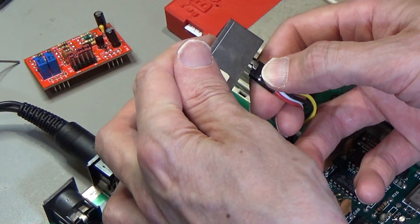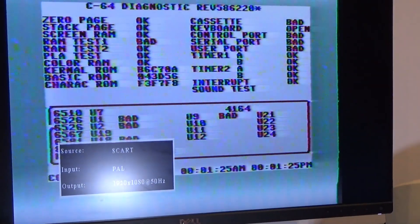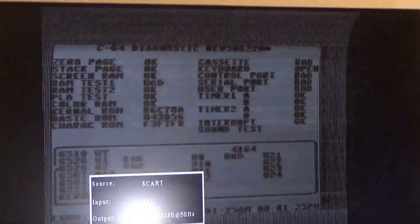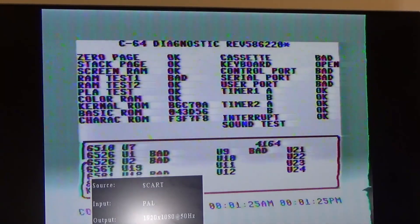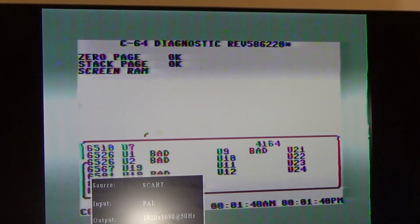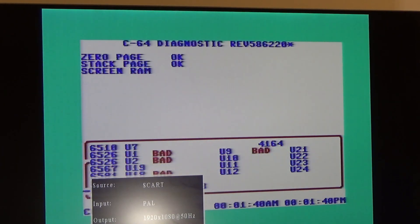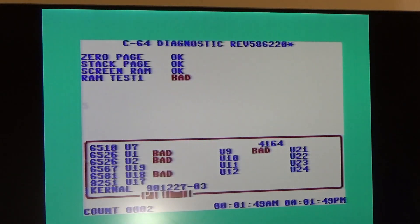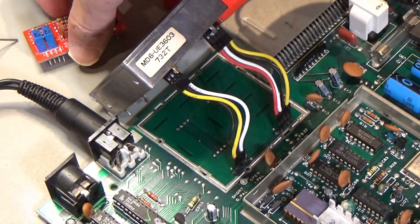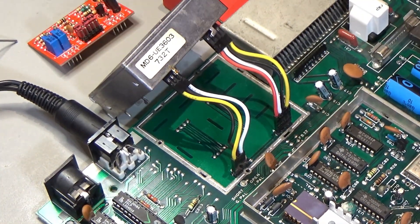And it's a little bit weird. Check out the picture - it's absolutely terrible. Now I've got the connections pushed in and it looks awful. And I discovered that if I take the shield of the modulator and just tap it against something that's grounded, it all just comes good again. So it's working when it makes good contact. Suddenly it's like really bad output because this modulator is not very good, but if I touch it against the shield on the cartridge port it comes good. If I take it off, it's all bad again. So weirdly, now this thing's out of the board on these fly leads, when it's like this it works pretty much as badly as the replacement. So that got me thinking - why is that? What's going on with the grounding on this thing?